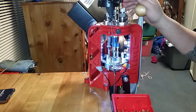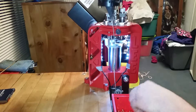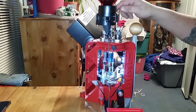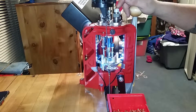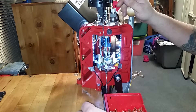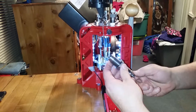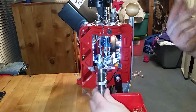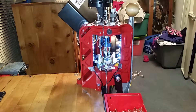Still running relatively good — machine's nice and smooth, keep it clean, runs good. I also had problems with my decapping die, so I put an old resizing die in there to deprime and haven't had a lot of problems since. I don't know if that decapping die is bent or what, but it just does not like to push out 9mm primers — not even on the single stage. I gotta fight with them, and I decap everything because I wet tumble. I think I'm gonna have to buy another one.